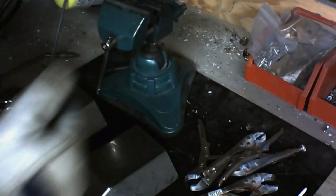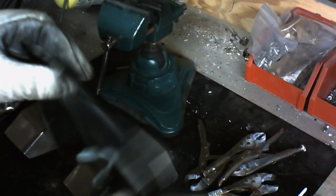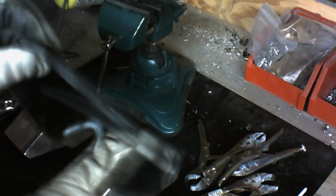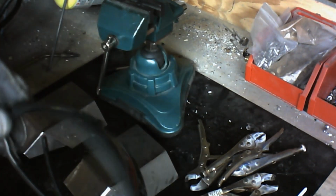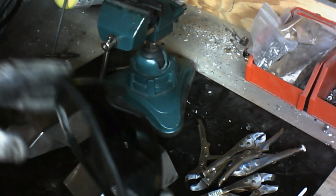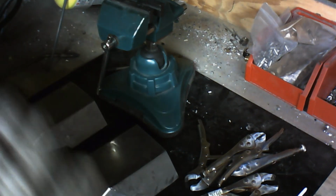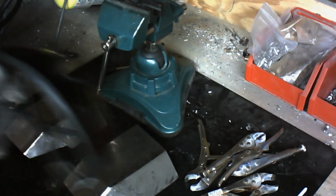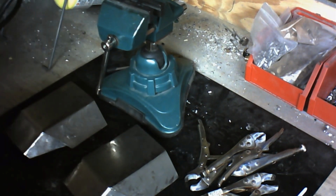Safety material, also: you want to make sure you've got gloves, okay? And you want a pair of darkened or shaded safety glasses. Now, one thing to remember about the brazing torch is that it doesn't get hot enough to produce ultraviolet rays. You have to get above 1600 degrees to produce ultraviolet rays. This does not produce that. It doesn't get hot enough for that, but it still gets pretty bright.